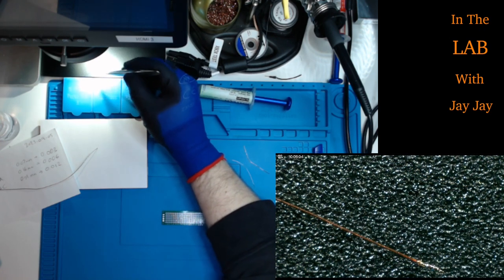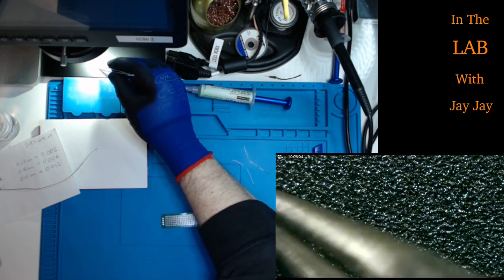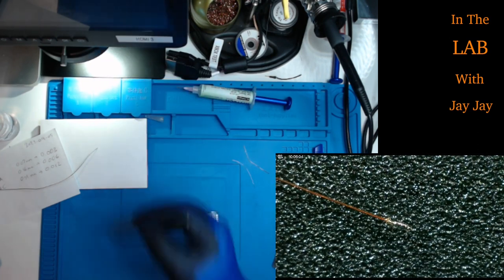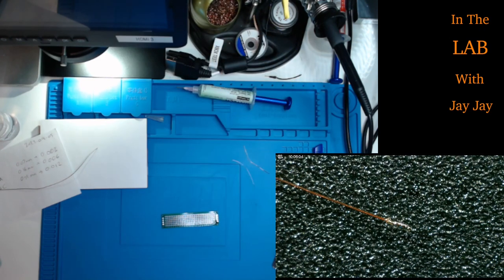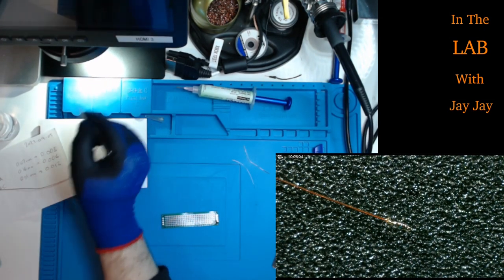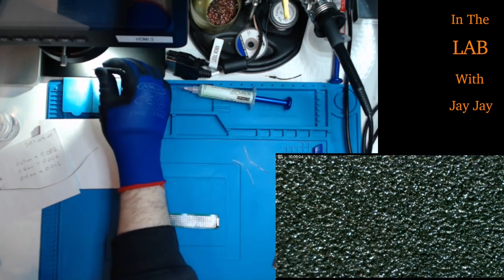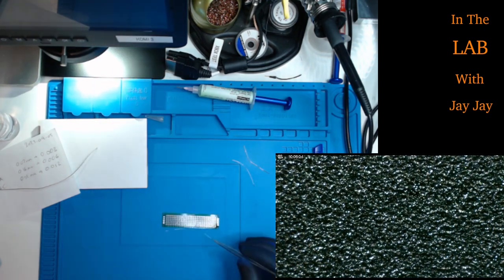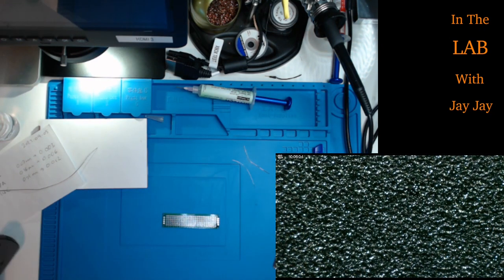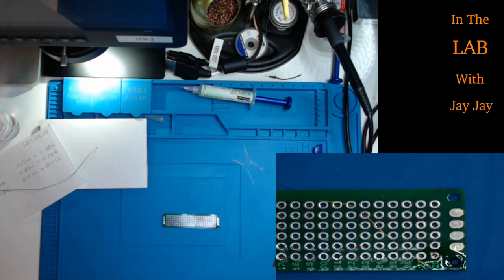Now, so you can see the enamel's burnt off the tip and it's tinned a little bit. I'm trying to get that in a good view for you. There we go, that's a pretty good view. So, yeah, you can see the enamel is still up on that side. The enamel is there. And on the tip, it's nice and tinned. So that's mission accomplished for that part of the exercise. So let's pop you back over to the bench. How's that going? There we go. It's going very well.